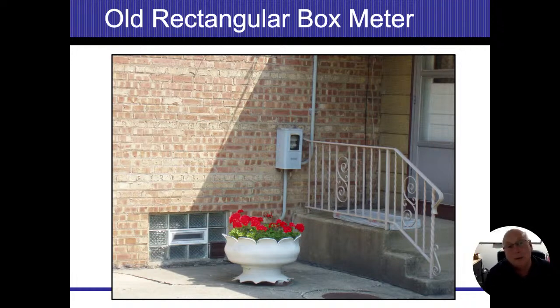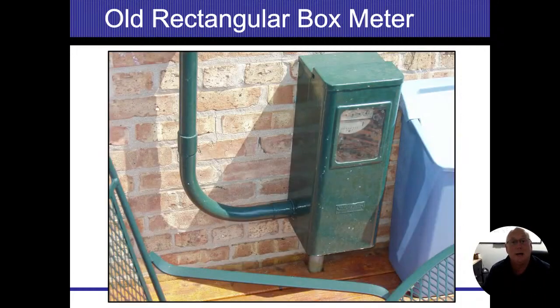And without getting inside of it, we're not going to know. But yeah, if you start seeing 100 amp services on these things, that means somebody changed the panel and the wires coming in there. I don't think it's necessarily the end of the world, but a problem is never a problem until it becomes a problem. And if these things are only rated for 60 amps and we're seeing 100 amp service coming in there, we should be calling these things out.